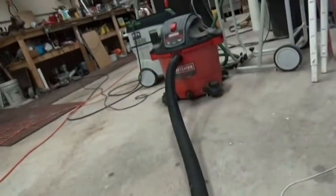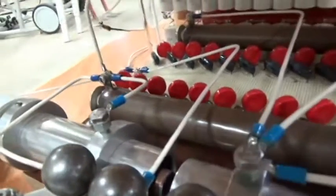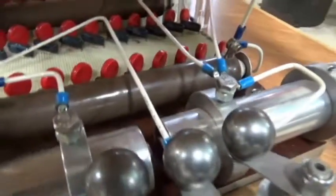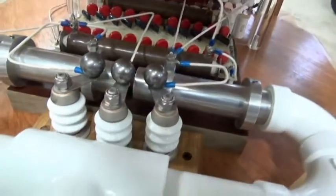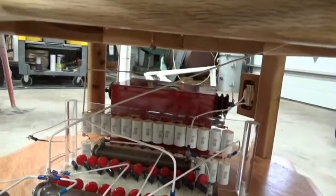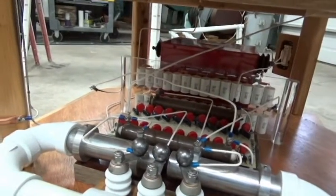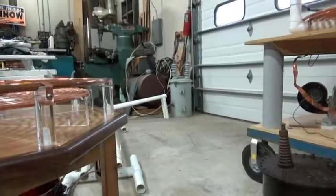Here's my vacuum setup on the arc gap. You can see the copper tip down in there — that copper's in there and the other electrode is over in there. This is my safety gap and my Terry filter, my MMC for the capacitor bank, and a burned-up 15,000-volt transformer. I was doing a first light test about two days ago and the transformer quit operating — we have a short in the secondary somewhere. So I'm opting to use my pole transformer, which is sitting right over there.